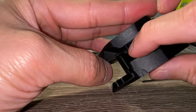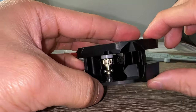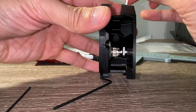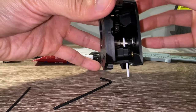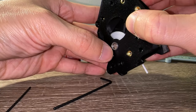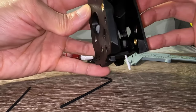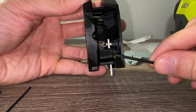There is no need to over-tighten this top bolt that is in open air — the plastic will bend and break before you can even get torque on it. Insert a piece of filament and check drive gear alignment. Since the set screw is loose, we can adjust the gear positioning as needed. Make sure the shaft does not stick out on the large gear end. This is the worst set screw to tighten due to lack of clearance and it strips easily.